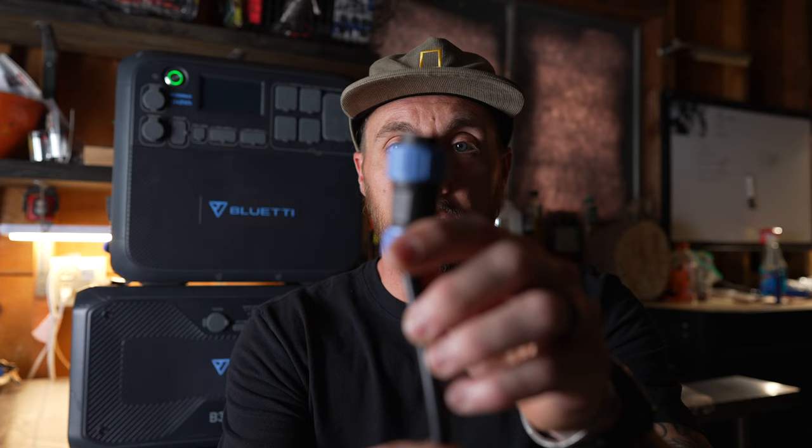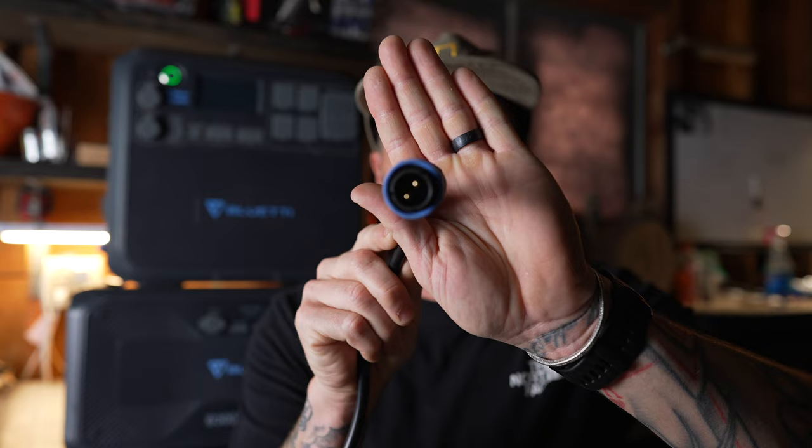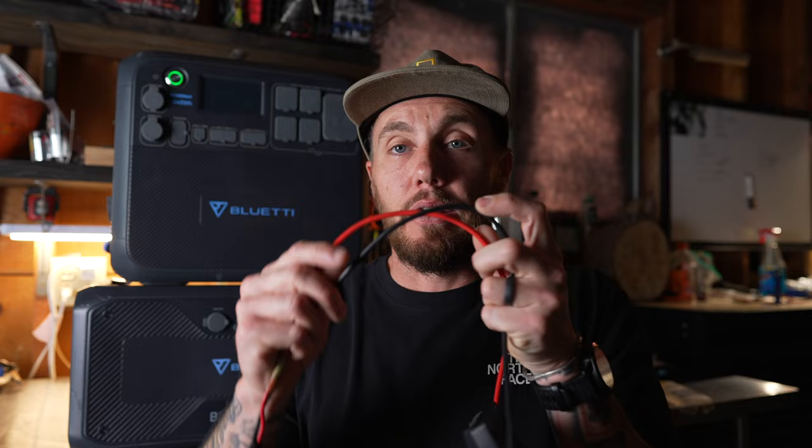So let's talk the aviation plug. It has two pins that go directly into the two slots on your AC200 Max. You connect this together, spin this down — it's got a little head on it — and it locks it in there. This aviation plug does not come modified the way I have it modified; it has a different end on it. What you have to do is simply cut your aviation plug. I left as much length as I possibly could, cut the end off, stripped the wire back, and crimped on two other wires. These two wires are 12-gauge — a 12-gauge positive and a 12-gauge negative connected to the positive and negative of your aviation plug.